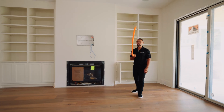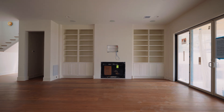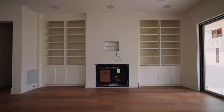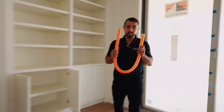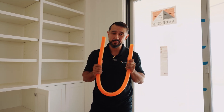In the living room, conduit is used for future wiring — whether it's an HDMI or a service line. Running conduit for your service line and in fireplaces, where you may have a future HDMI going from your television into a cabinet, is going to be extremely critical for a successful smart home TV installation. That's tip number two.